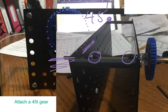So you're going to always put 2 rubber collars on the inside, which will help. One will get butted up against this side of the frame, the other one the other side of the frame. And there is a third one right over here on the other side of the axle. So bushings are the 2 white bushings. You have your 3 rubber collars, 1, 2, and 3. I have my drive collar, which was attached to my 45 tooth gear, and I just slide that on.